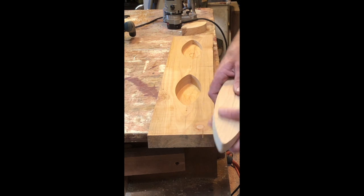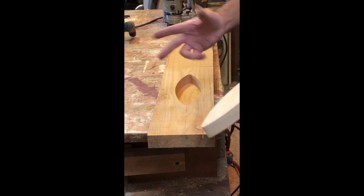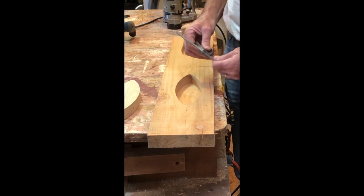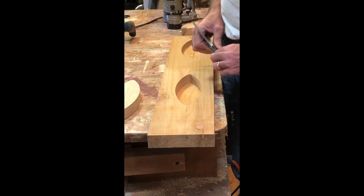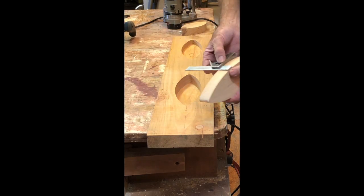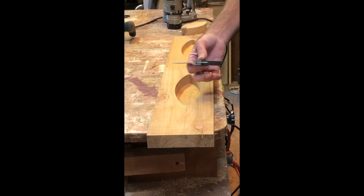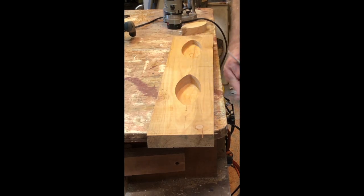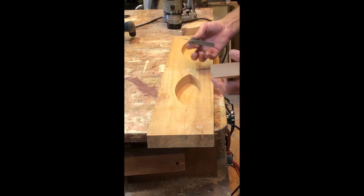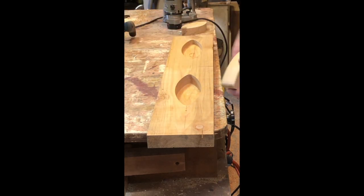Okay, so here's one of the plugs that you're going to be getting a whole box of. I haven't grooved this one yet to match the tongue and groove of the siding there. But double check your depths of everything. Double check the depth of the recess against the thickness of the plug. You will be doing all of that in your setup phase on the router anyway, because as I said before, once you take the pattern off, it's really tricky to get it back on in exactly the right place. So in any event, just double check that all your thicknesses are correct.